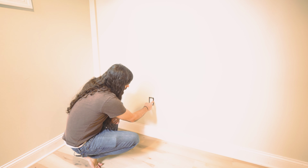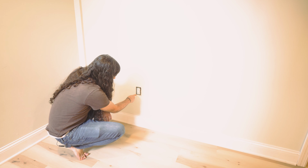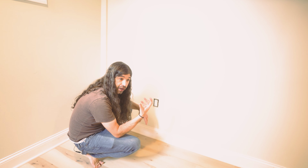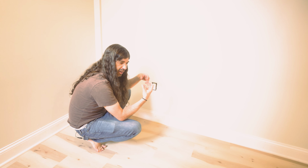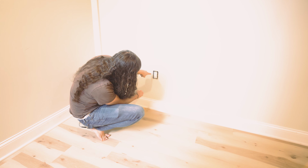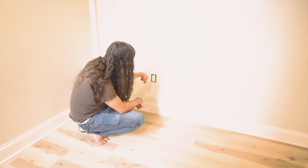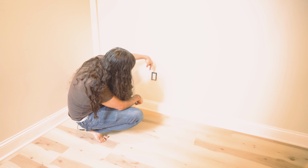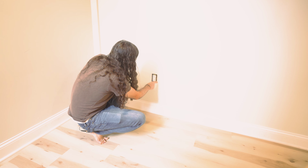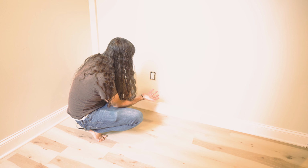All of the outlets, this is the one we haven't done yet, but we've been taking acoustical caulk as well, and on the outside, you never wanna fill the inside of the box. On the outside, we're doing a border of acoustic caulk around there as well. What I should have done is they make acoustic fireproof padding. It's like this thick, Play-Doh looking stuff that goes on the outside of the workbox. Because the problem is that these workboxes have little holes on the inside where the wires pass through, and sound can actually go in through those holes and then out. So by sealing this at least, and also I'm going to be putting some padding in this area, that should do a decent job of it.